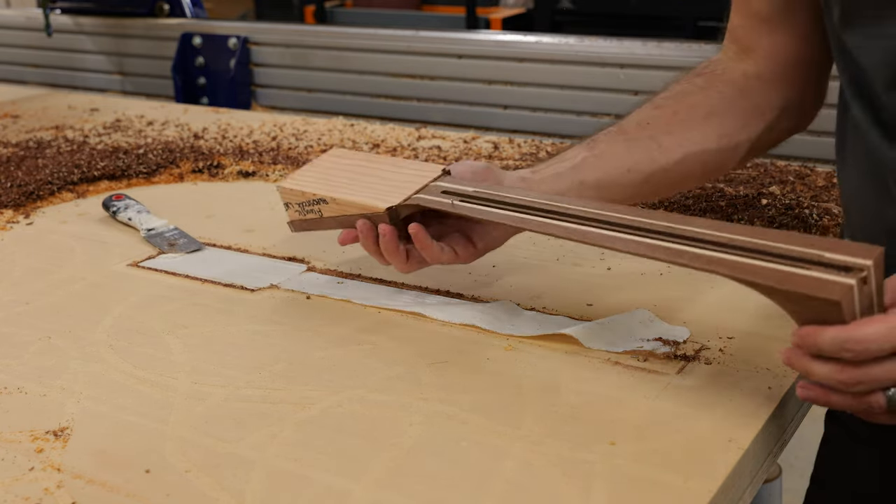I blend the transition area between the neck and top so the fretboard sits flat against the guitar's top — technically creating a slight fall at the fretboard end, which actually helps prevent fret buzz. With the fretboard surface sanded flat, I cover the truss rod with a thin strip of tape before gluing on the fretboard, making sure to remove the tape before clamping. The same 1/16-inch dowels used on the CNC also locate the fretboard during glue-up, then everything gets clamped with red clamps while the glue cures.